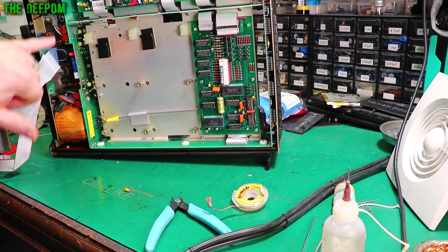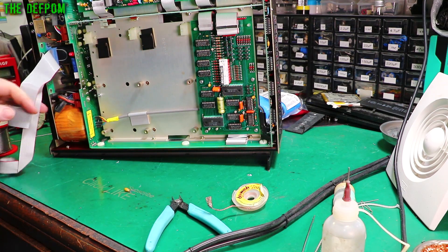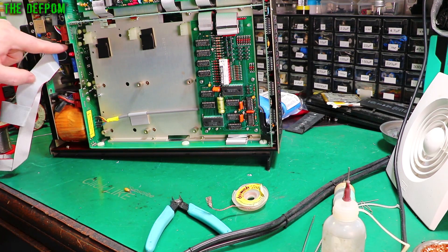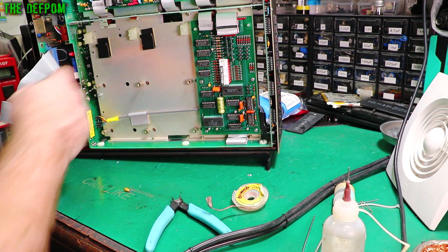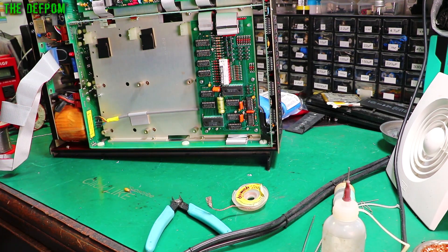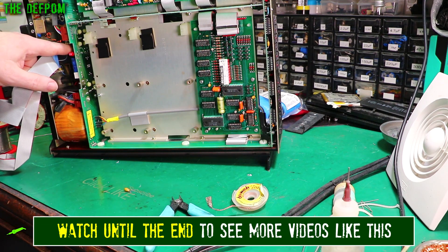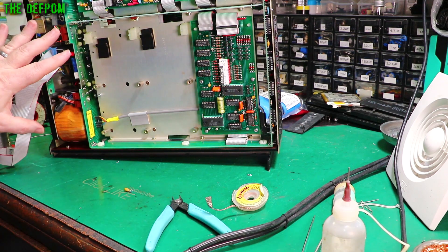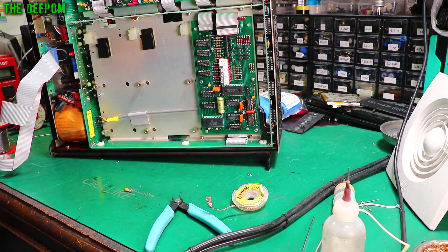To do these capacitor replacements I also took the GPIB board out — here's the ribbon cable. I'll move that out of the way so I can access the solder joints more easily. The main thing was for the tantalums because they're hard to get to down there. I need to get the connectors out of the way so I can reach the tantalums properly. I've got two tantalums to replace now — those are the 15-volt rail ones with the 25-volt tantalums. Then I can put it all back together and work on the analogue board on the other side.